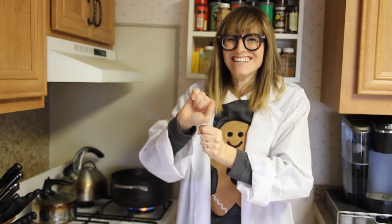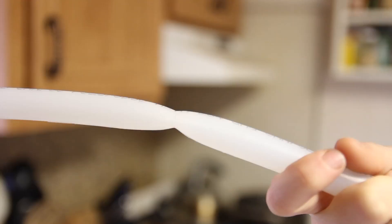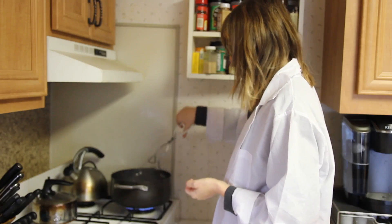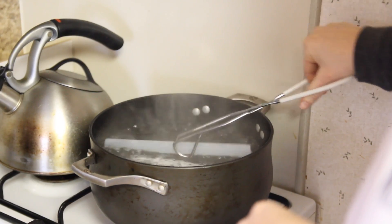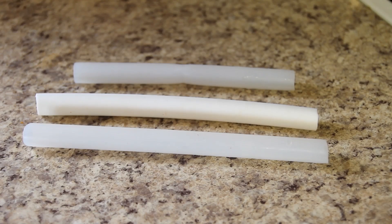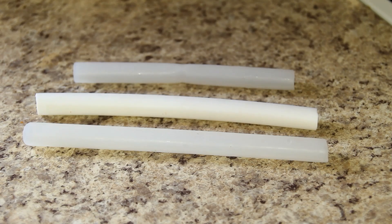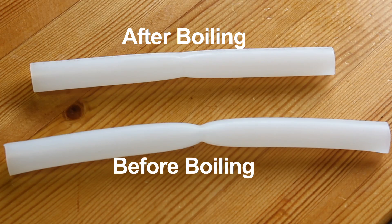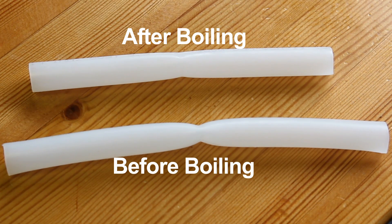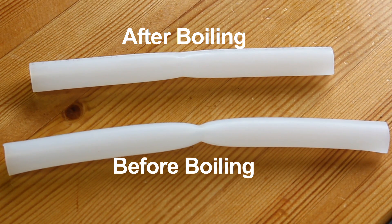Is this a trick? Here we are after 45 minutes, and we're going to see what happens. Today is a happy day for people that have PEX installed in their home, because literally nothing happened. Our PEX held up perfectly after 45 minutes of sitting in boiling water. The one thing that we did notice is that the PEX A pipe that had a kink in it started to come out a little bit.